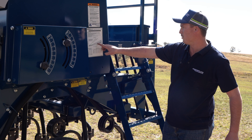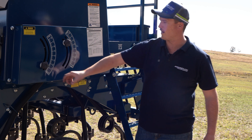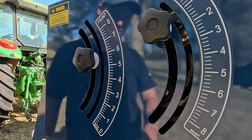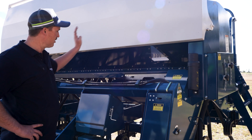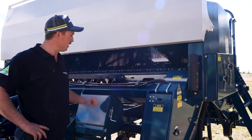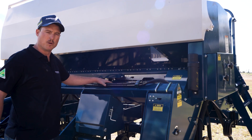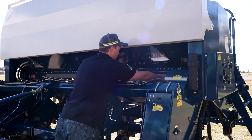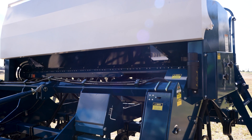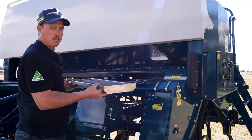Today's gearbox setting we will start with is five and a half — that is this front gearbox setting and we're going to aim for five and a half. Now that we've set the gates, the restrictors, and the gearbox setting as per the calibration chart, the next step is to put our wheat in the hopper above the calibration tray in the five outlets. We will also pull out the calibration divider, place it aside, and put in our nice stainless steel calibration tray.